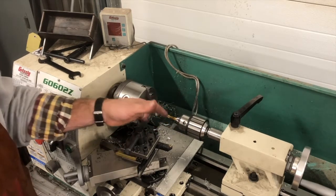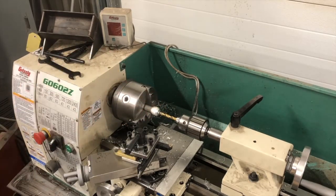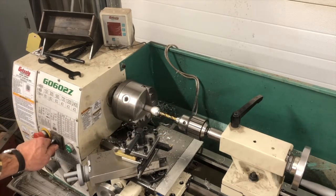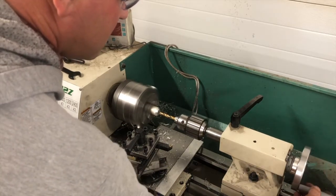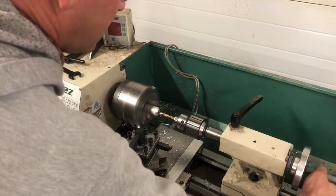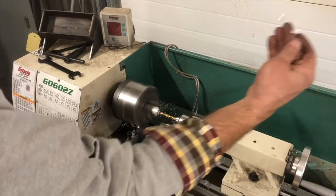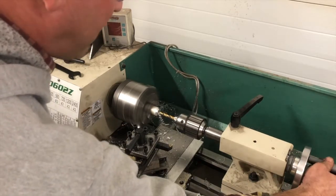Now to drill, I need to cut that in half — 50% speed for drilling — so I'm going to turn this at 600 or less speed. I have it set even less than that, which is fine. So I'm going to drill this part with this twist drill. We're going to turn it on, turn this, and then back it off, turn it some more, back it off. When we back it off it breaks that chip so we don't have a super long stringy chip. We got some that's lengthy but it's not going to get too long and wrap around everything.